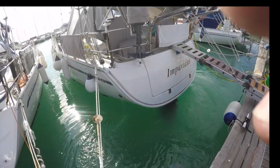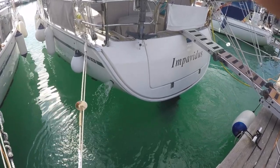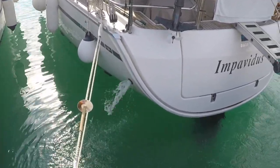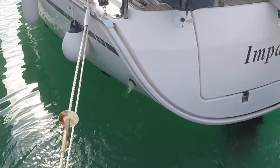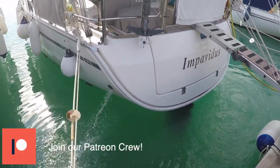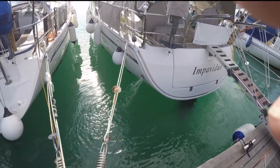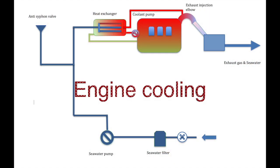Finally, if you see white steam coming out of your exhaust it's highly likely that there's some kind of interruption in the flow of raw water. Remember — steam dissipates in air, smoke doesn't, that's how you tell it's steam. We hope this video's been useful. Remember to like and subscribe, or even become one of the Patreon crew — for just a few pounds or dollars a month you can help support the making of these videos and help other people out too. Thanks for watching and sail safe.